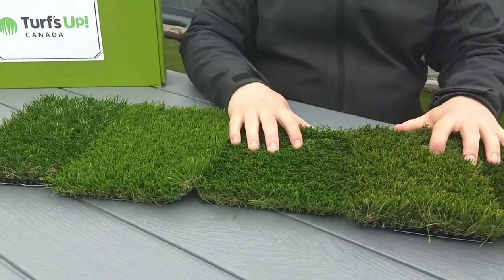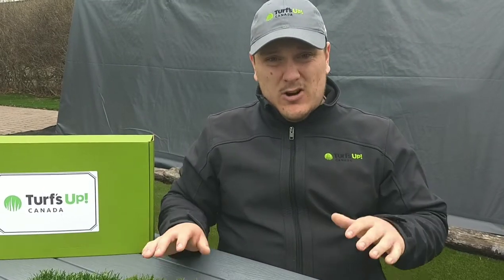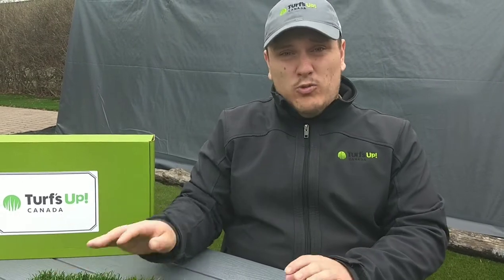When you're looking at these measurements, consider what they tell you about the product. Oftentimes people just throw out these numbers — they think higher face weight or higher pile height might be better for what you need, but that is not always the case. There are many factors to consider when picking an artificial grass. We just want you guys to know what these measurements mean in terms of density and length. Consider our other video about fiber shape, because something with a lighter face weight but a really strong fiber shape might still handle traffic, whereas something with a flat fiber might have a long pile height but mat very quickly in a high traffic situation.